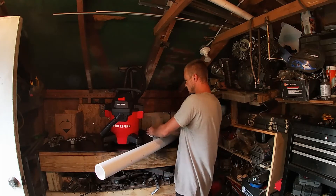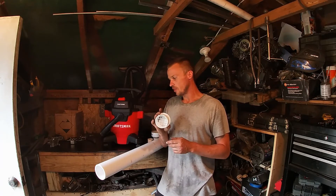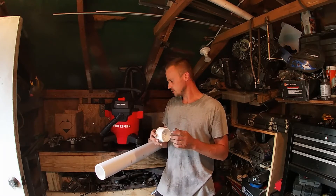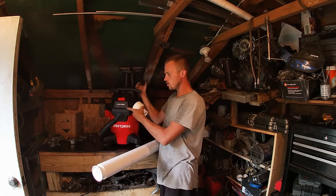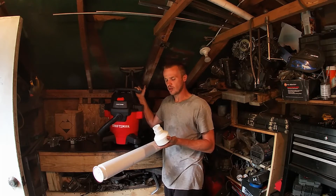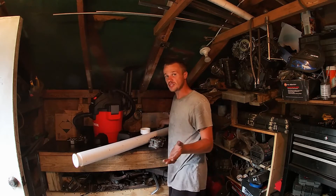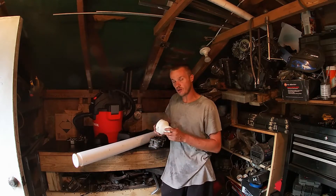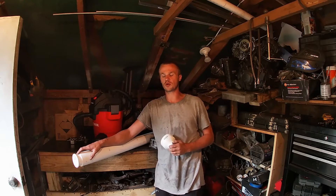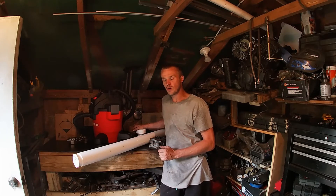You need something with the same inside diameter as your cylinder wall. This piece right here is the closest thing I found in PVC that is the size of my cylinder wall — it's a tiny bit smaller so I'm going to have to take a little bit out of this. My vacuum that I just bought — now you could use a bigger vacuum, I think this flows 60 CFM, so you could definitely have a bigger vacuum. It's still going to tell me if I've improved on my design or not. This can flow different cylinder heads, but for each cylinder head I want to flow I'll have to have a separate adapter. This right here is going to be for a 2.756-inch bore, which a Predator 212 engine has. So I can get different adapters and fit them to this pipe to flow different cylinder heads.